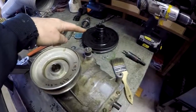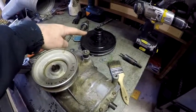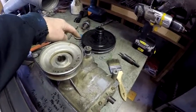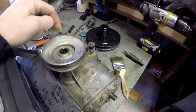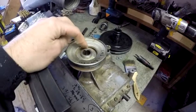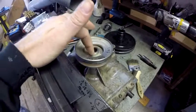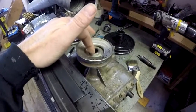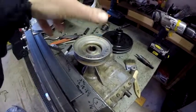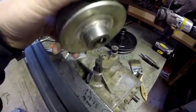If I want to run a completely different design on the engine pulley, I want to be able to bolt pulleys to the hub. So at any time I can unbolt a pulley, leave the hub on the motor, bolt a new pulley to the hub, and have a different gearing. To do that, I want to do the prototyping on the rear pulley first. The first one you build is always a prototype, so I'd rather build it back here, because I don't ever plan on changing this rear pulley out once it's on there.